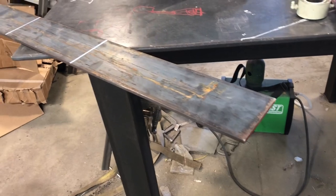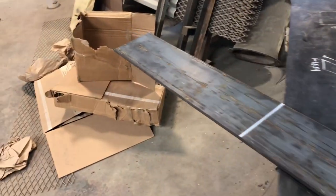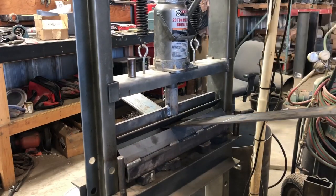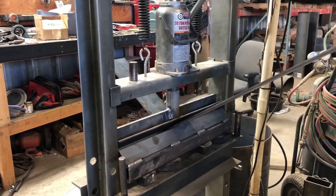What's up guys, let's get started. We're gonna build this out of four by quarter-inch flat bar. I made two white marks there — that's where I need to make two 90-degree bends, essentially making this a U-shaped piece of steel.